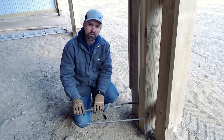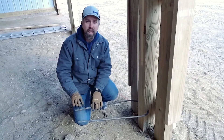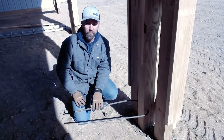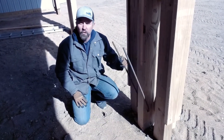The other thing it does is help prevent any sort of uplift on the column. When you have that added weight of the concrete floor tied into the column permanently with a stick of rebar like this hairpin, it will really prevent any possibility of any sort of uplift. So that's a rebar hairpin.